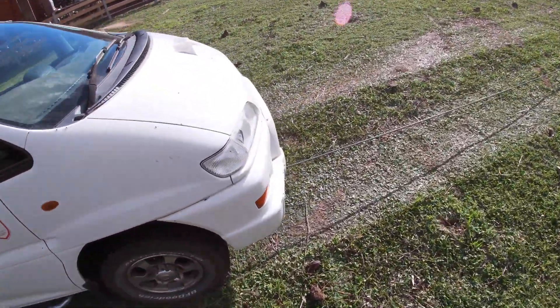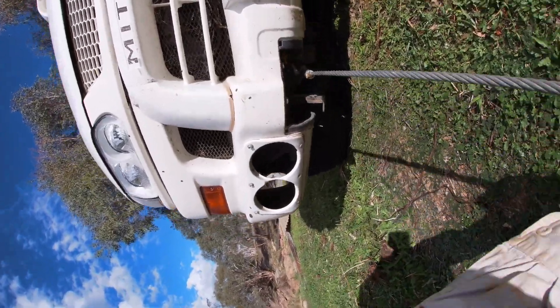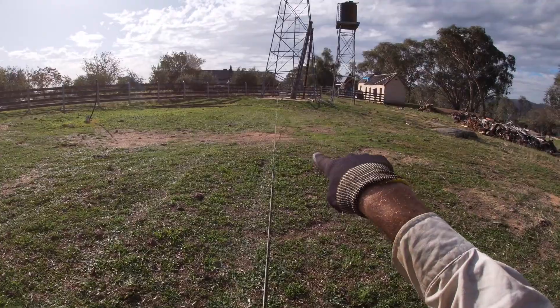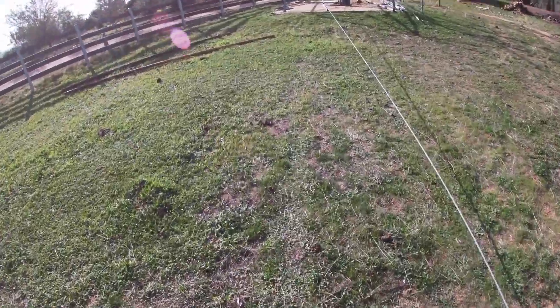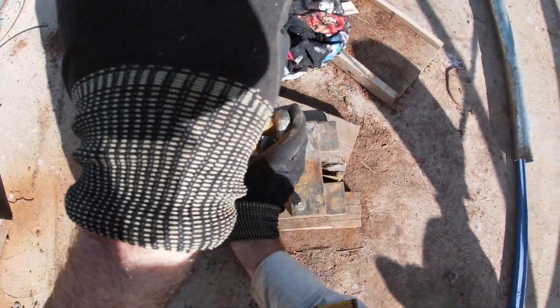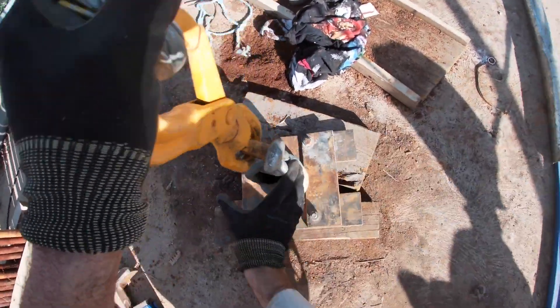What we're doing: we've got a steel wire rope joined onto the car here with the shackle, and we're pulling through one pulley, through a second pulley, and then lowering down the pipe column into the bore. We've got it supporting here under a little bit of load so I can just hold this shackle and easily spin it to undo it.